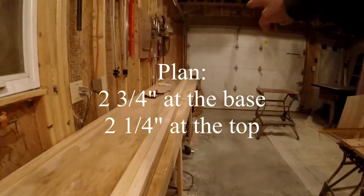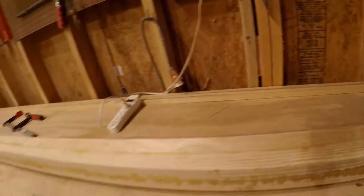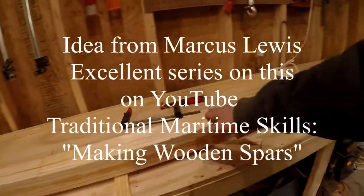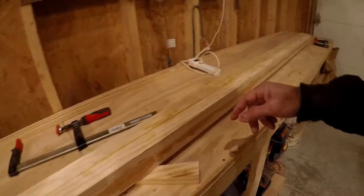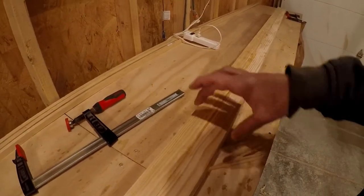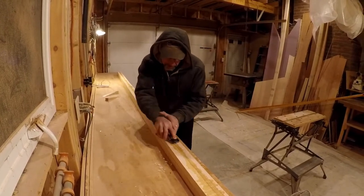Base diameter is two and three quarters, tapering to the top diameter of two and a quarter. I'll start by laying out those very gradual curves such that the halfway width is two-thirds of the way up — so it tapers more quickly toward the top. That's a really gradual curve, and then cut it. I wish I had a bigger blade on my circular saw. I'm going to have to cut it into a tapered square shape and see if we can get these lines laid out for the edges that have a lot of built-up epoxy and take the high points out.